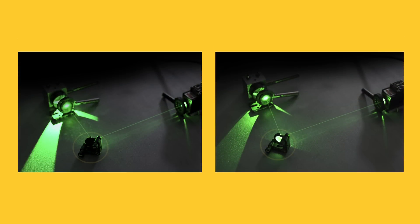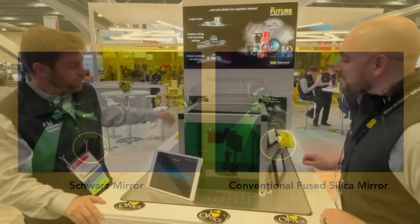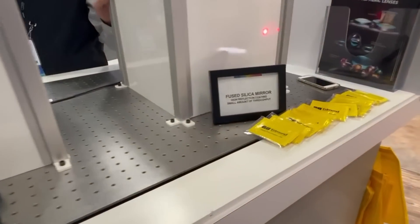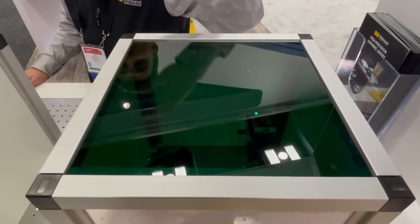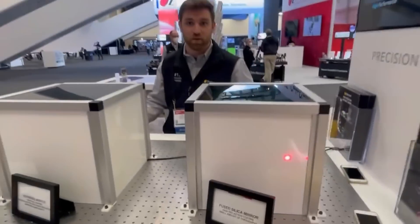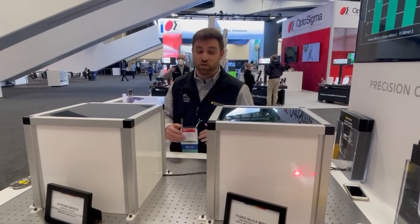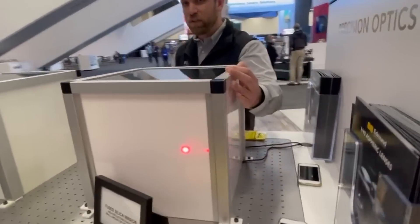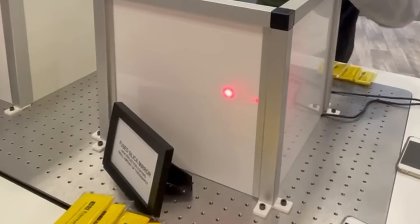We had a pretty cool demo comparing these two different types of mirrors at Photonics West 2022. In this box right here, we have one of our fused silica substrate mirrors with a high-reflective coating on the front of it. We have one laser reflecting off of this mirror, and one of our wireless Bluetooth power meters measuring the reflection off of this mirror. Unfortunately, fused silica is totally transparent in the visible range, and as you can see on the front of this box, the little bit going through this high-reflective coating is transmitting straight through the mirror and leaving a red spot on the back.